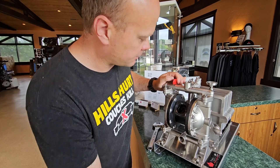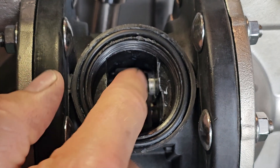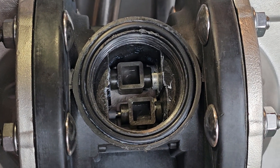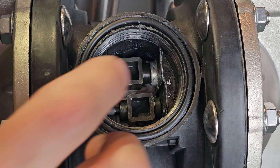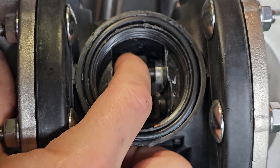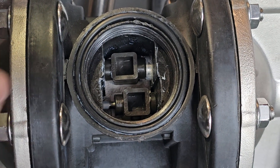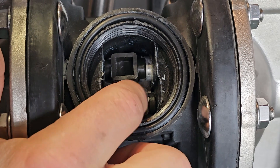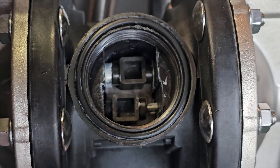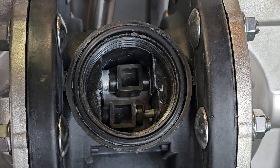Take a look inside here. When you take this cap off, you should be able to see these two actuator switches. The bottom one is to the right and the top one is to the left. In shipping, it might be that they're both off to the same side, or both in the middle. It doesn't matter what position they're in as long as they're opposing — right now the bottom one is to the right and the top one is to the left. In normal operation, these will always be opposing one another.